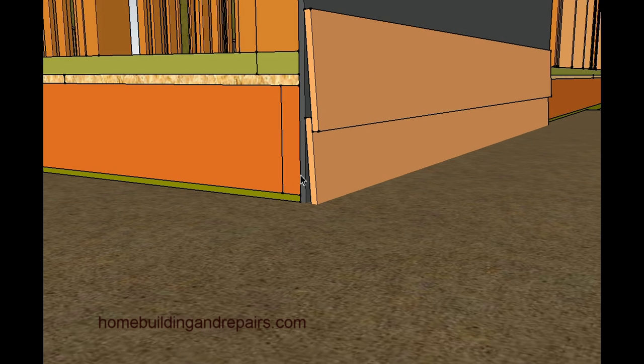If you have a house like this, the soil level will need to be lowered. The minimum distance that most building codes require is six inches from the top of the soil to the top of the building foundation — not the bottom of the siding to the top of the foundation. So if your siding is an inch below, you would only need five inches between the bottom of the siding and the top of the soil.